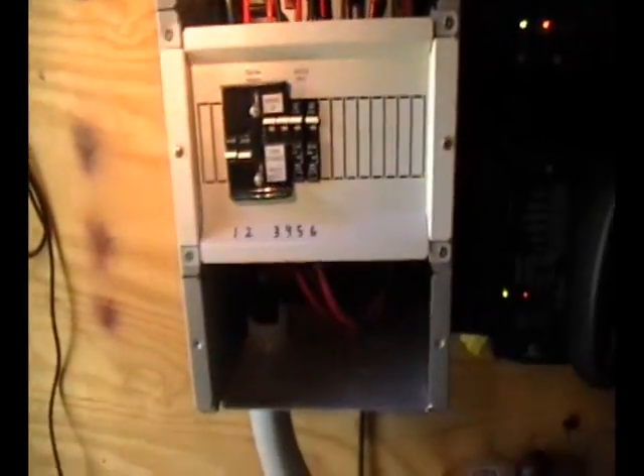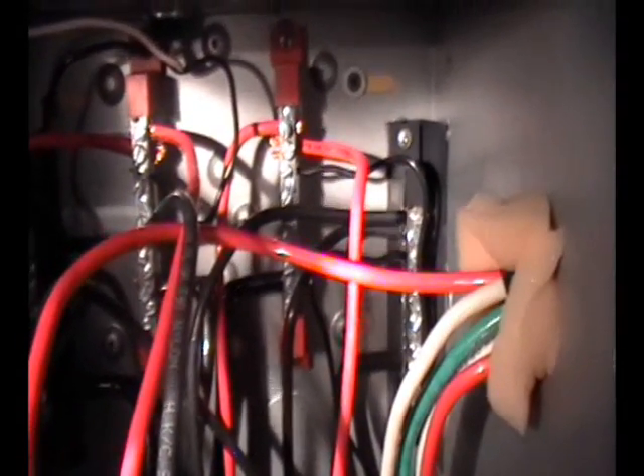The wires are connected together with Polaris connectors. The AC wires come in through this box, through this panel, and into the bottom of my FlexWare AC panel. In this FlexWare AC panel there are two buses for the hots and two separate buses for the neutrals. Essentially the AC backup circuit going to the backup panel and the grid tie circuit going to the grid tie panel are separated.